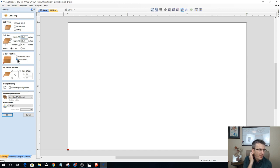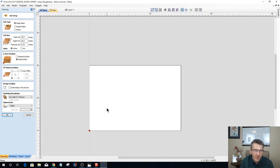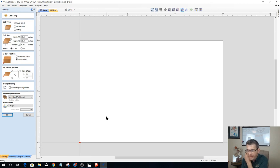I work off the bottom of my material, which is my spoil board, and I work from the bottom left corner. You would set your zero position, your Z0 position, and your XY datum, your start position, your XY home, your XY0. Three different names, all the same thing. Your datum, XY0, XY home, your start position, that all means the same thing, okay? And I work from the bottom left corner of the material because of my particular jig and setup.